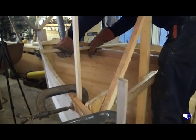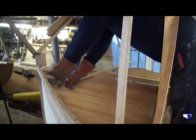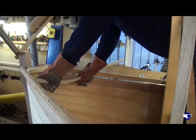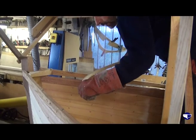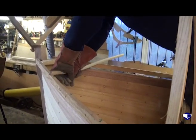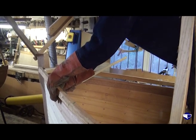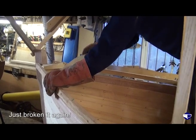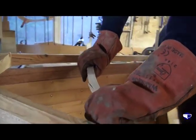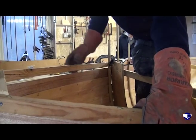We've got a section of rib with a bit of a curve on it — we could just try giving it a bit of a bend, but it's going cooler all the time. It broke because of a big knot, so the grain shouldn't be too bad if that knot section is kept up. Giving it a bit of edge bend — a bit of bend that way. Still not quite enough bending to get it to lie flat on the plank, and this end is going stiff now. And I've just broken it again. Trying to bend it edgeways is obviously much more difficult for the oak than bending the other way — that's just a grain failure. Not to worry, we're doing alright.